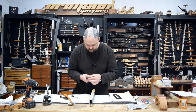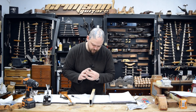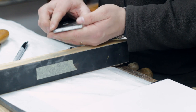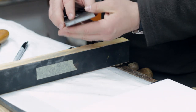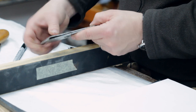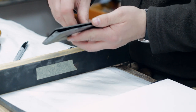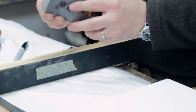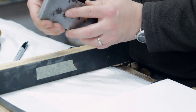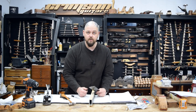Maybe I should be working on a harder surface like a workbench without something soft on it. So go in, double check that I've got the right thing and that I'm not creating a gap there. Something else that can happen is that you don't have enough of an angle there, and when you put the bolt in, it's not actually holding the chip breaker down. You just don't have enough tension there to actually keep it held down. And that is something that does happen and you need to watch out for.